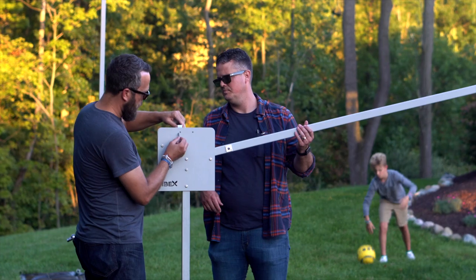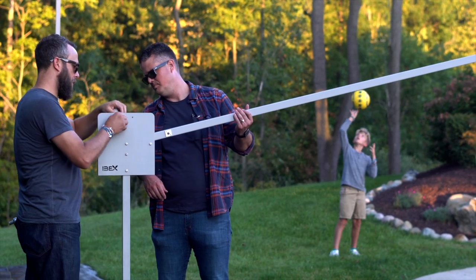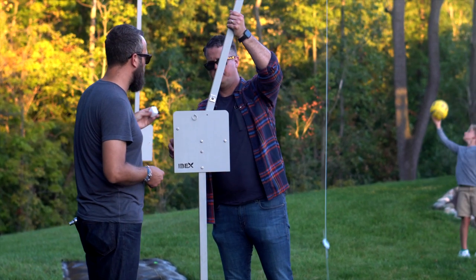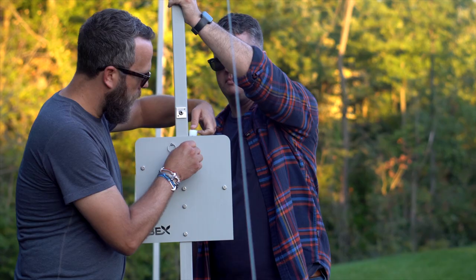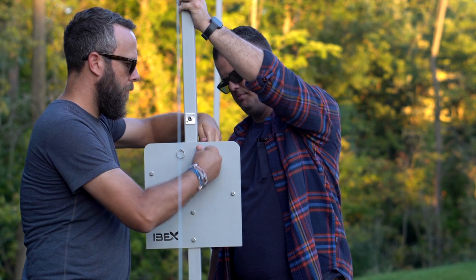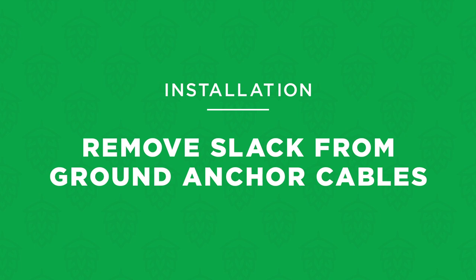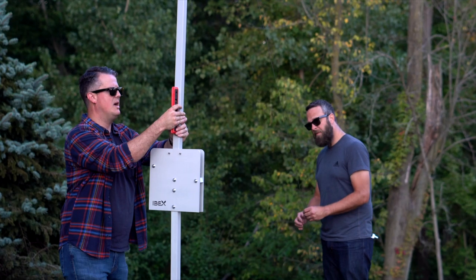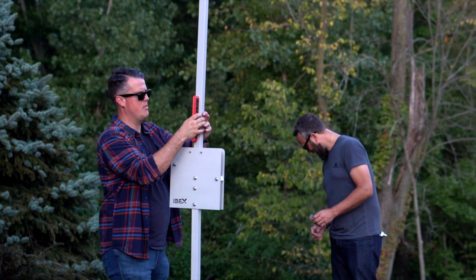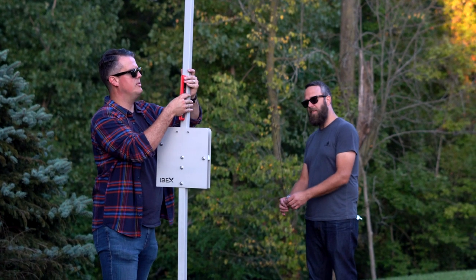Next you'll install the front and rear removable blocks that support the upper trellis arm when it's in its fully upright position. With the trellis arm in the upright position, insert the front block between the side plates and align the hole with the hole in the plate. Secure the block with one of the removable detent pins. Insert the rear block in the same manner. Repeat this process for the other end of the trellis. With the trellis arms in the fully upright position, check the first arm with a level to make sure it's plumb. Have a helper pull the upper ground anchor cable through the cable connector to remove the slack, then repeat for the other trellis arm.